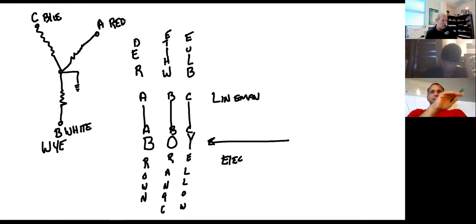Or the RWB, right? What publication designates that? The Shoemaker book about doing it right. Okay, you know, because the NEC will tell you brown, orange, and yellow. It's for three phase. The NEC will tell you that. Are there any publications that state that I need to be red, white, and blue on the utility side? Yes, sir. Every utility in the United States. Okay, so I'm going to have to do some investigation on it. Does it need to be written down for you to do it? Just when it comes to regulations and stuff like that, I don't know.